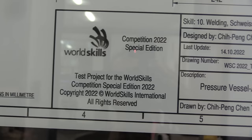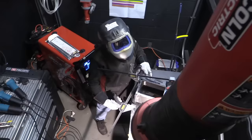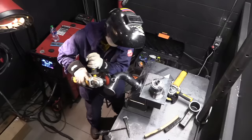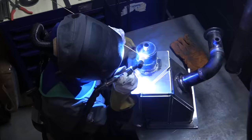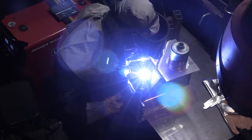The competitors are supplied a drawing, and each weld is specified — what process to be used, the weld size, things like that. And if the competitors accidentally make an extra pass or extra bead on a weld that wasn't called for, they can be disqualified. So reading drawings is another part of this competition. The parts need to be fit up as per the drawing, and deviation from the specified processes or weld size is cause for a loss of points.